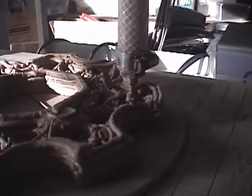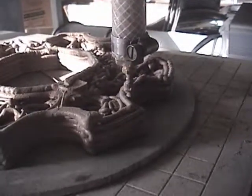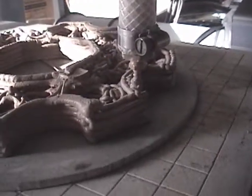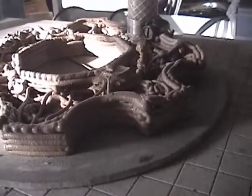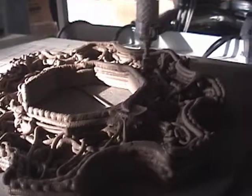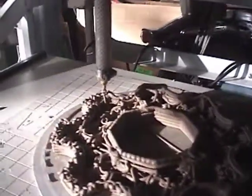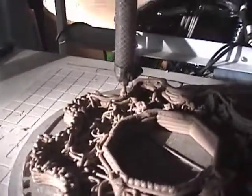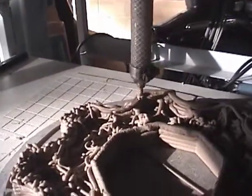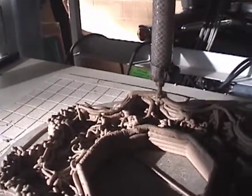It's so high that the clay has a chance to curl before hitting the layer, so it's wandering. In the first few layers it wasn't so far that it could do that, but now I'm getting curlies. So maybe a four millimeter step height would work better.